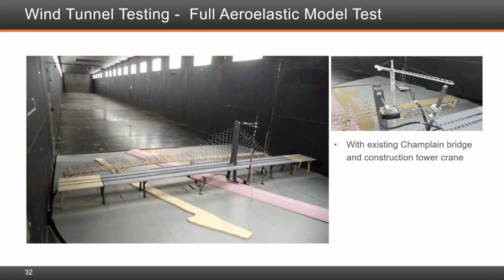Okay. Was there any stage post-tensioning on the stayed cables during and after construction? During construction, of course, the stays were stressed in multiple stages as the segments were erected in the main span, and accordingly, the back span to balance the moment in the pier were also stressed so that you don't have, if you will, unbalanced loading on the pylon.